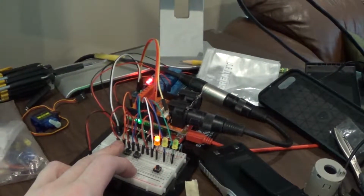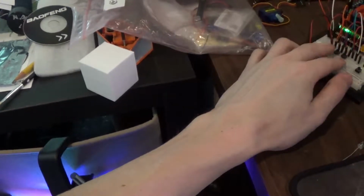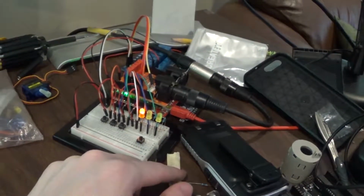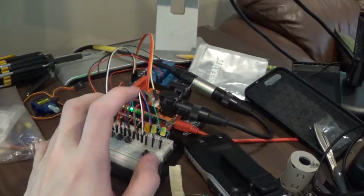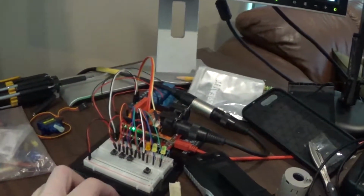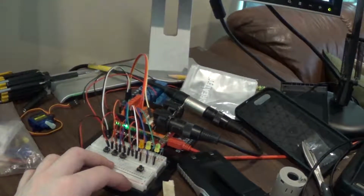And then also I need to fix this where if I turn it off, it still holds the DMX values. But that's not too big of an issue because it'll cut power anyways. But I want to see if I can figure out how to toggle pass through, either using the onboard stuff or by using relays or transistors. I know I can't mix the DMX signals, and I'd much rather just plug in from my PC to this than having to unplug this and then plug into my computer. But that's a minor thing.